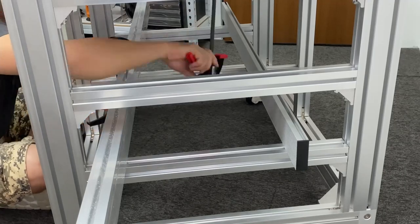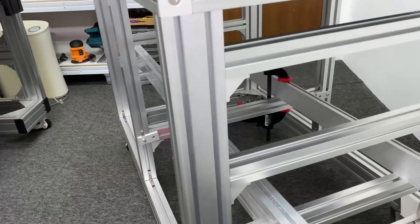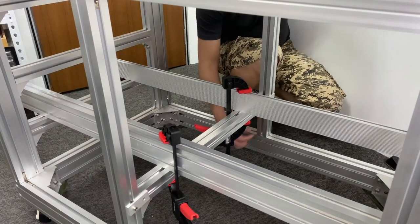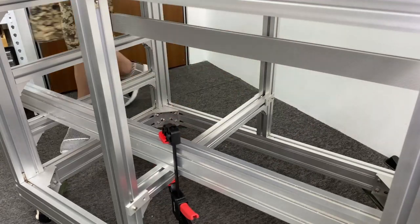The middle arms are held up by clamping up to the straight edges. This way, the whole plane is going to be at the same exact height. This will make the drawers align well later on. The process is repeated for the rest of the arms, to provide for 12 drawers within this table.